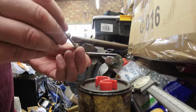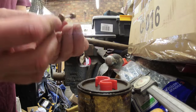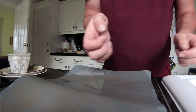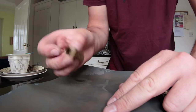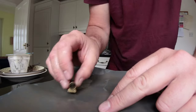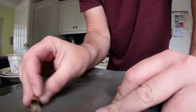I'm just inspecting and cleaning, and I don't think there's anything really wrong. These pistons are quite a nice fit. So here I'm going to lap the second cylinder. This one has definitely got a little burr on it somewhere, and you can also see the machining's just not all that fantastic, so probably a bit leaky.